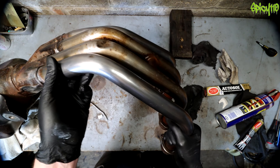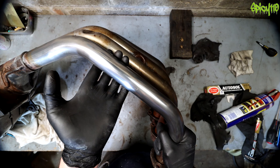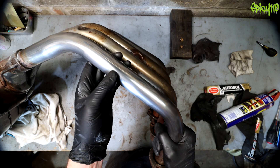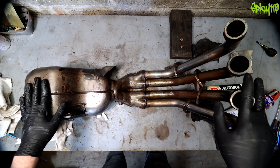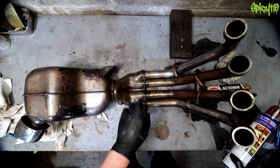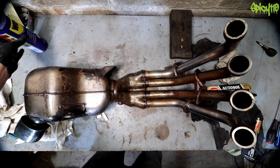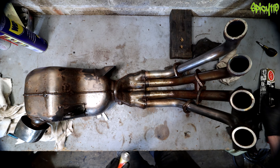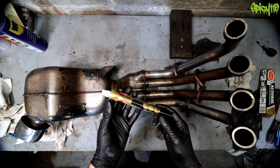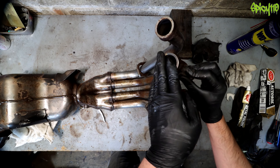I'm going to quickly show you something I can do with an angle grinder — obviously using one to polish your entire exhaust isn't practical, but just to show what's possible if you kept going. As I realized, I didn't need to do this exhaust fully to show you what a transformation can be done using simple stuff: medium-fine wire wool — be careful with it near batteries or anything flammable because it catches like you wouldn't believe. WD-40 is great for breaking the bonds between rust and cleaning it off. Autosol is the best metal polish I've ever used — I'm not sponsored, it just works best.